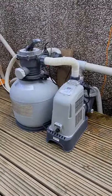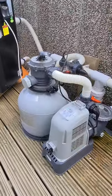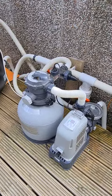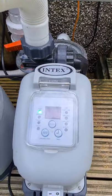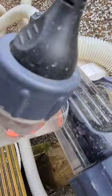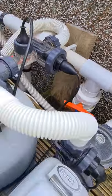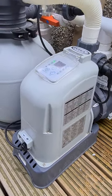I'm about three years in with the 24-foot Intex pool. Setting it up for the third time, I filled the pool with salt water, and what I've noticed is that as I run the pool pump, I'm getting the service light going red and it shuts down. The salt cell is no longer generating bubbles and converting the salt water into chlorine. It seems there's an issue with the salt machine itself.